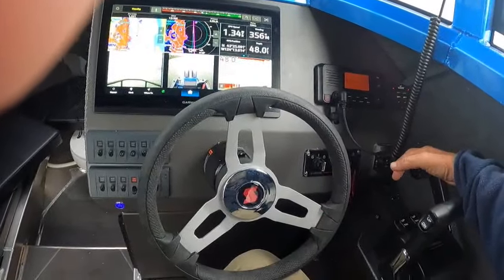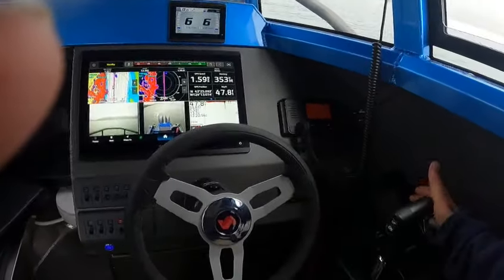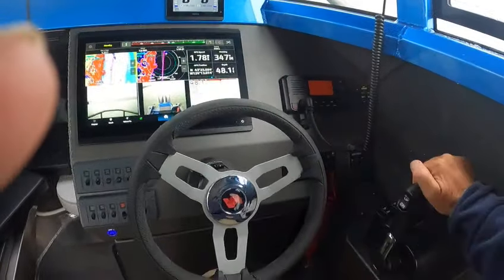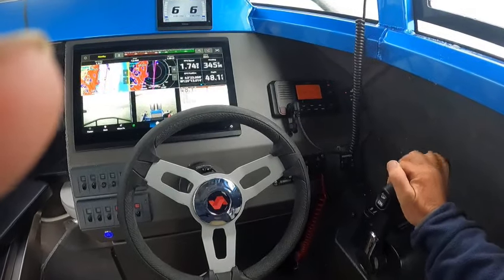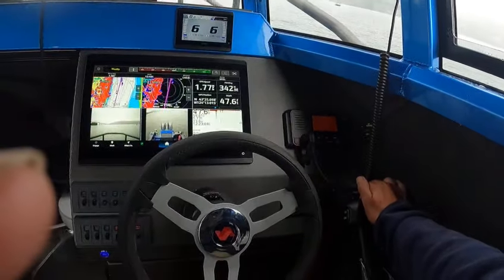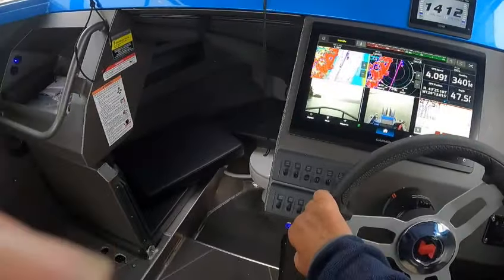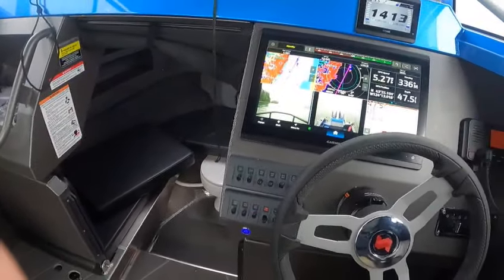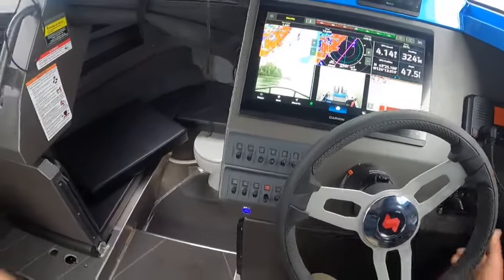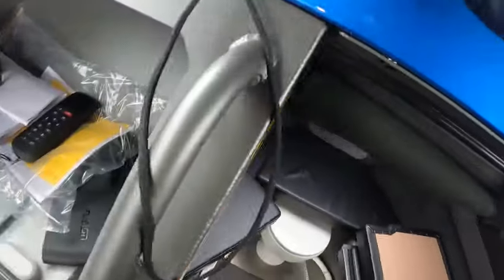Now if you're going to go over here, make sure the motors are straight. I'm going to bring it over here just by hitting that one ahead a little bit without having to steer my wheel, then put this in neutral. Maybe go over this way just a little bit to get out of these guys' way. I'm going to do that bow mount. Put that in neutral, shut her off. Get the motor straight, then get up into here — so this is your bow mount right here.